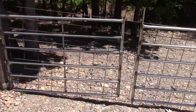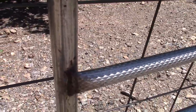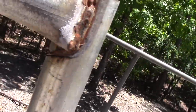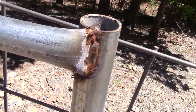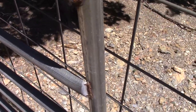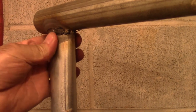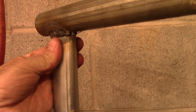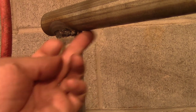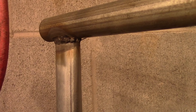It just took me a while to figure out easy ways to connect the conduit together and weld it up, and I just thought I'd pass it along. This is an example of another gate made in that same fashion. These were actually commercially made — some of the welds are kind of rough. See this one, you can see they've got wires stuck all over it. Now this is another variation — kind of a poor welding job — but instead of flattening the conduit all the way and welding it to the front, I just flattened it about halfway, and that gives you a profile that will actually match up with the edge of the conduit pretty well.